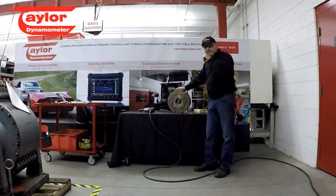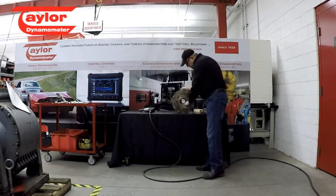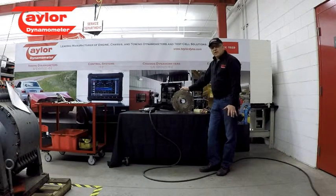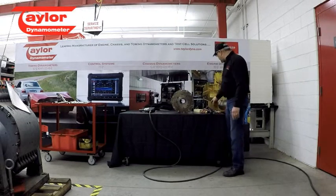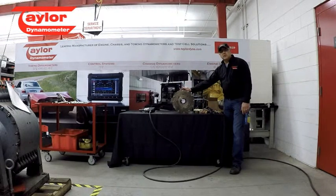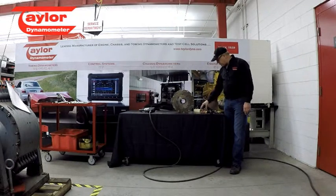Here we are — we've got the coupling fully assembled and it's ready to go back on your machine. When you do reinstall it, make sure the bore of the hub is clean. It's okay to run over it with an emery flapper wheel to clean it up. You do want to put it on dry, and make sure the shaft is clean and dry as well. It's a taper fit, so you don't need Loctite, you don't need to heat anything, and you don't want to shrink it on. Reinstall the nut on the end of the shaft and torque it to between 200 and 300 foot-pounds — about 225 foot-pounds will hold it on. Make sure you use plenty of blue Loctite thread locker on the threads at the end of the shaft.